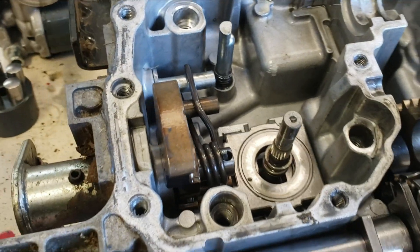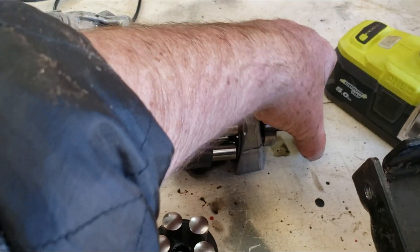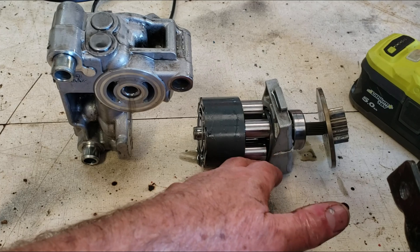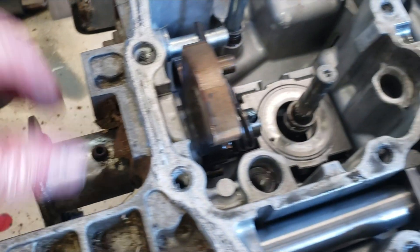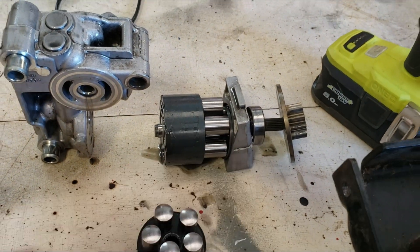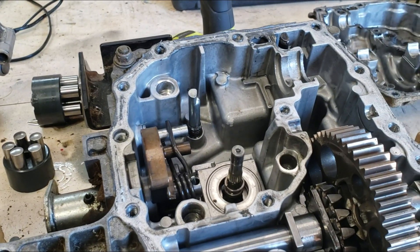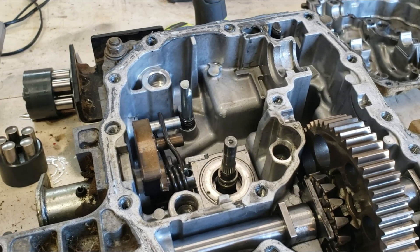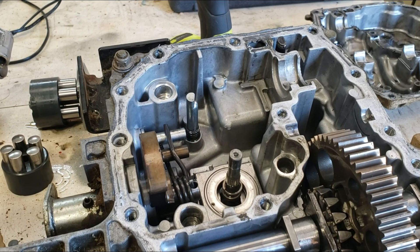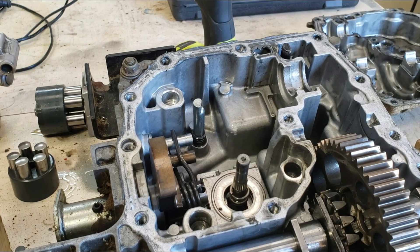That's the drive pump basically, and then the motor pump over here is exactly the same, except this angle is set — it doesn't change. So you change the speed by the drive pump, not the drive motor — the pump motor — which is set to a certain angle and just goes as it goes. I hope that explains exactly how these K46s work. All very simple for a hydrostatic drive really — just basically two oil pumps, one driving at the same speed all the time, and the flow output changes depending on your pedal position.